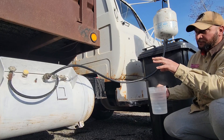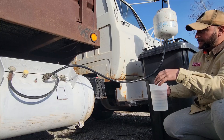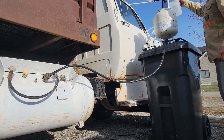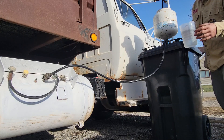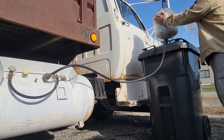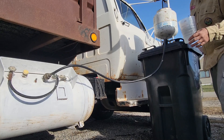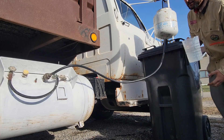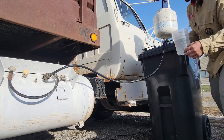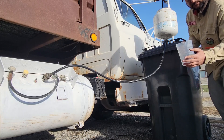It's actually been flowing fairly quickly into the receptacle tank because it's so low. I'll need to repeat this process probably two or three more times because this is a large tank, and I have some larger bottles feeding into it as well. Since we're getting near the end of this tank, I'll start pouring more hot water over it, which will help feed the propane and also let me check how much is left in my delivery tank. It seems like I've got very little left. You may not be able to drain all the propane out — when I first started this process the tank had about a third left and I couldn't get all of it, but we'll see. Warm water over the delivery tank works perfectly fine, and shaking the tank is a great method too.